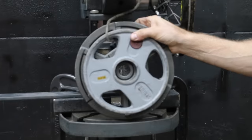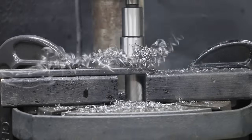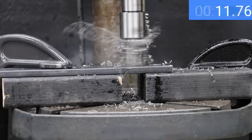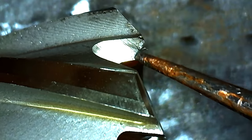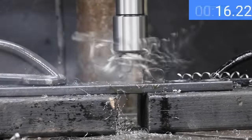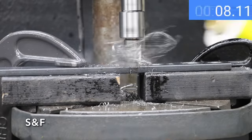Moving on to 3/8 inch mild steel, with 15 pounds on the feed wheel — very close to 110 pounds of downward force. The cutting oil does a great job keeping the Steel Dragon cool, and the Steel Dragon made the cut in 31 seconds with a minor chip on one tooth. The Evolution was two seconds faster than the Steel Dragon in aluminum and is six seconds faster in mild steel at 25 seconds, though it did experience a couple of chipped teeth. The Unibore is very fast with mild steel at 23.4 seconds to take the lead, with some wear but no chipped teeth.